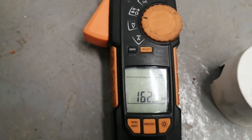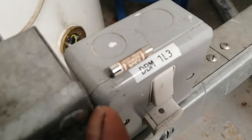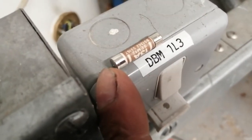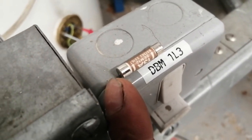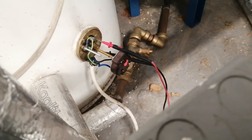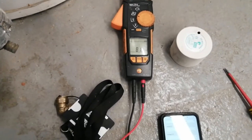Check out my resistance — it's all over the place. Hence why when I checked my fuse, my fuse was blown. So there's no need for me to even turn the power on and cause any problems. My fuse is blown, and I've done my resistance test and I can see that the element is finished. I hope that's helped you — until next time, bye bye!